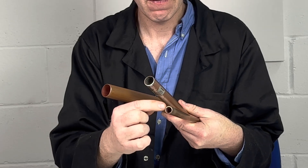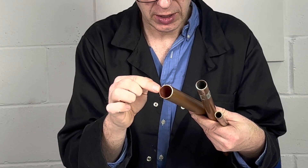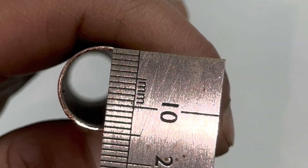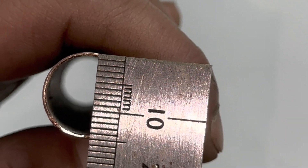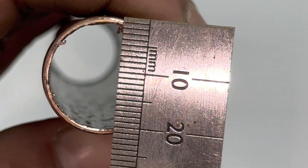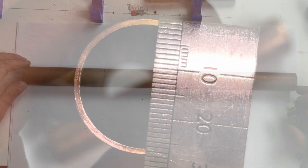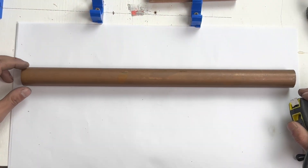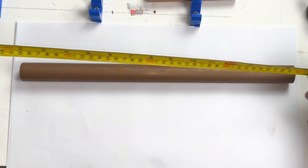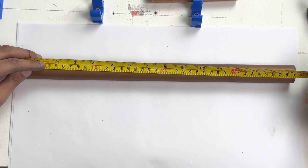So 15mm, 22mm, and 28mm. Copper pipe is measured on the outside diameter, so for example 15mm pipe, 22mm copper pipe, and 28mm pipe. In plumbing when we measure pipe, we use millimetres. For example, let's measure and mark 300mm in readiness to cut.